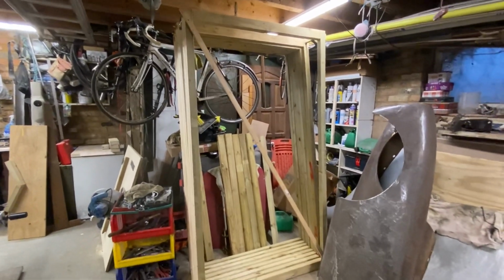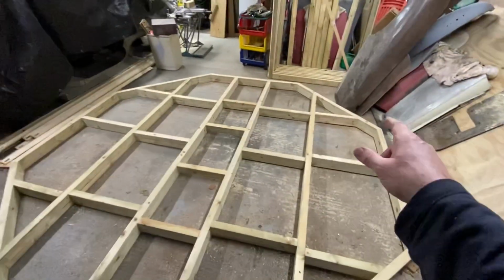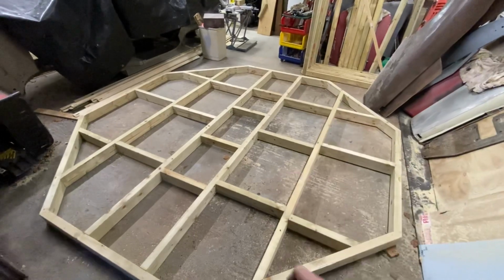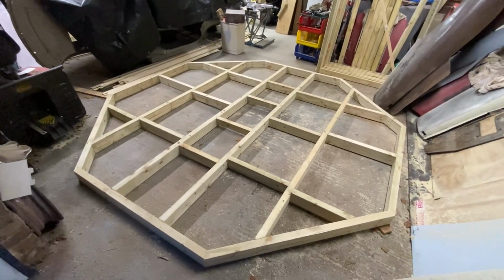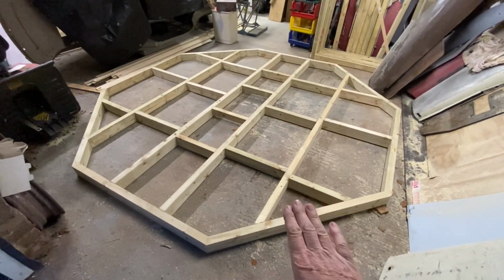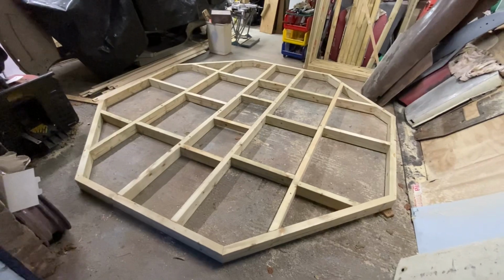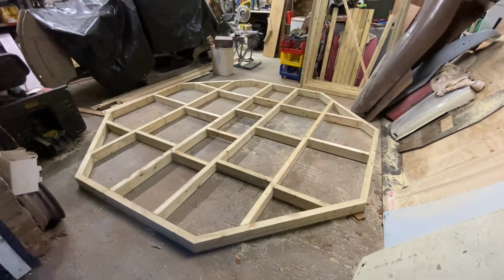So now next job is to just make a plate that goes above the frame. So I'm going to use the base as the template for that. I've got some 5x1 to go there, so I'm going to make that up while I've got this assembled in the garage, before I take this up the top, and then from that plate then I'll start to build the roof rafters and get the shape together, and I'll do that in the garage, so I'm outside, out of the wet and the cold.